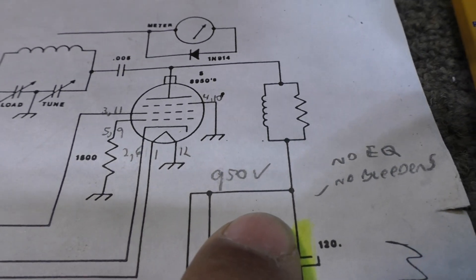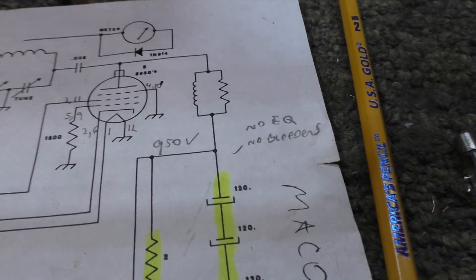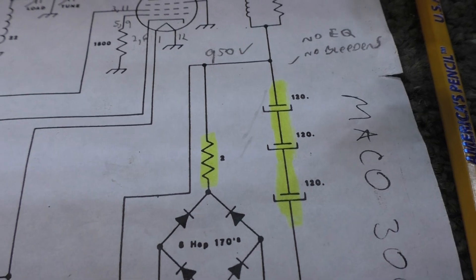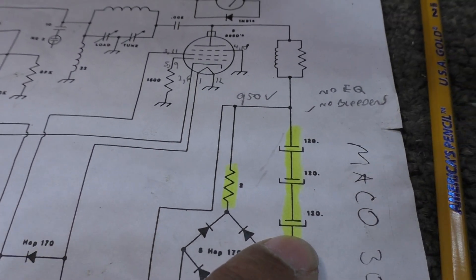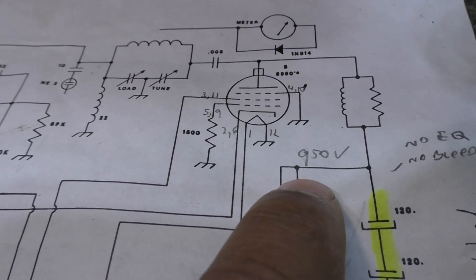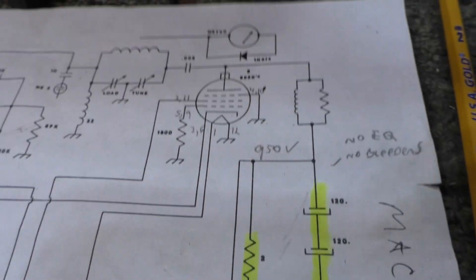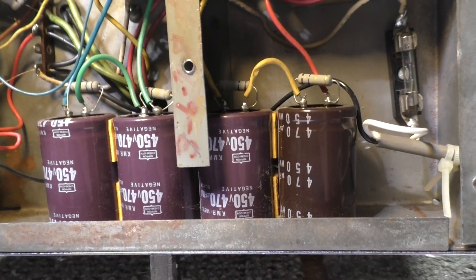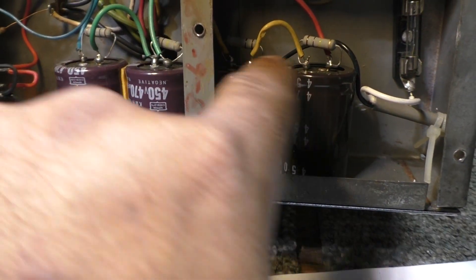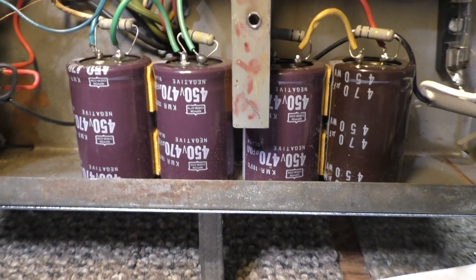Over here, the three caps in the schematic were originally 120 UF at 450 volt. I've got that this high voltage runs at about 950 volts, which is a lot for a sweep tube, but Makos ran them a little bit high, a little bit hard on the tubes. So I looked at this and thought, wow, they went to four capacitors instead of three. Why did they do that? Going by voltage, each capacitor in series is 450 volts — so 450, 900, 1350 volts capacity for a 950-volt actual. That gives you about a 20–25% safety factor with three. So why do you need four? I was wondering myself, and I'm glad I looked into that. At first I thought, hey, they did pretty good — these are Velcroed or glued in solid, nothing loose, got the bleeders on top. The guy didn't do a bad job — converted to four caps. But why? It's unnecessary.